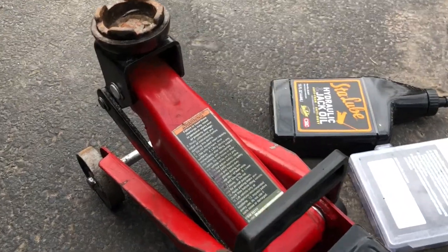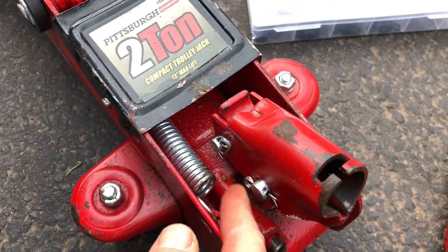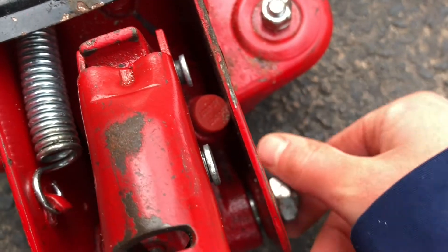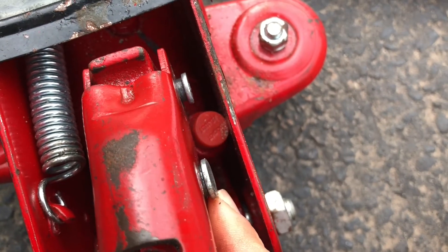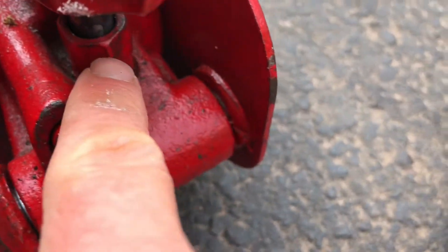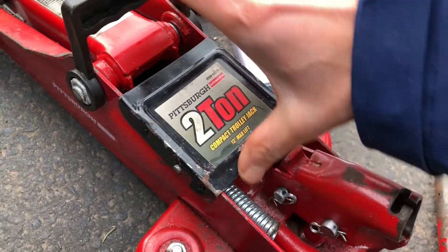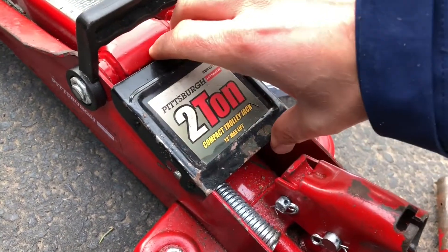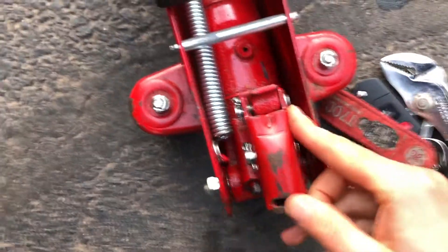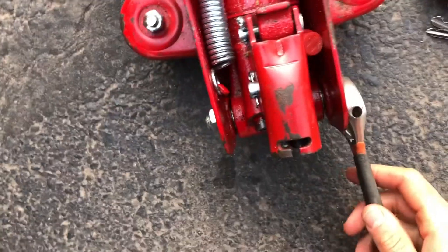It'll take many pumps to raise. There's not a lot of oil left. We'll remove this top piece. There are two cotter pins to remove before sliding the pins out to the right. We'll loosen this nut to have more room to remove both cotter pins, and we'll replace the o-ring in the main cylinder and then refill the main piston. Remove the top by pushing and pulling — that exposes a port to refill the jack. For easier removal of these two pieces, be sure to use channel locks.